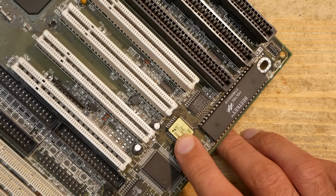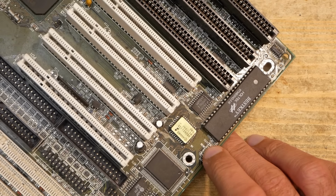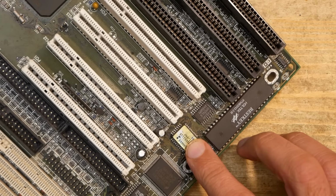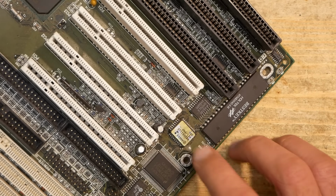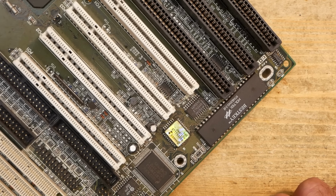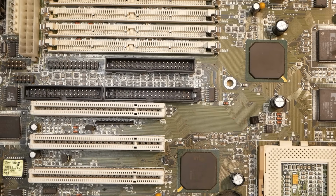The bad thing, which I don't like about it, is that the BIOS chip is soldered directly to the PCB. It is fixable of course, but would be better if it would be socketed from the factory. Just in case a BIOS update goes wrong, it would be much simpler to write a new BIOS or experiment with other versions just by switching the ICs. Well, we have what we have.